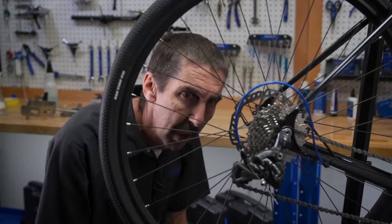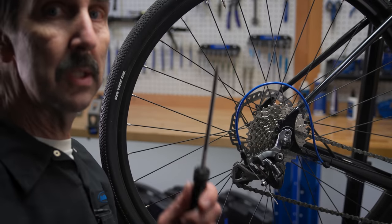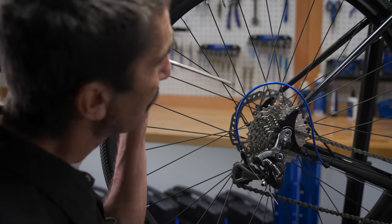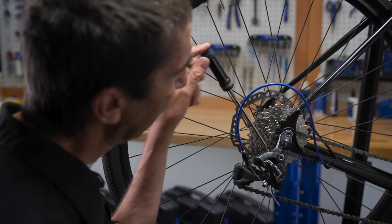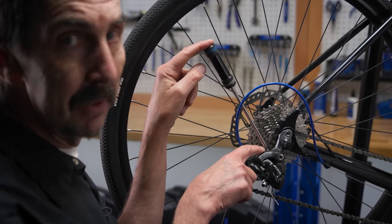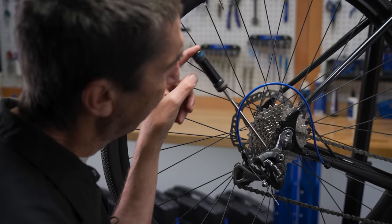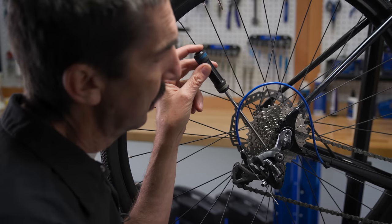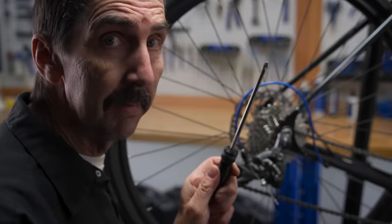Sometimes we need to straighten up and use the tool straight — basic and simple. Get in the habit of keeping it straight, in line with the threads. We engage the screw tip, and even a JIS-compatible tip is intended to be used straight. If you're off a little bit, being sloppy and quick, it can cam out. So keep it straight.